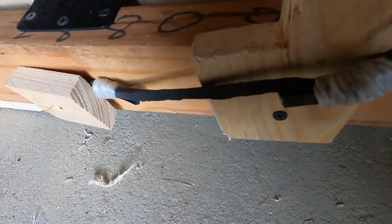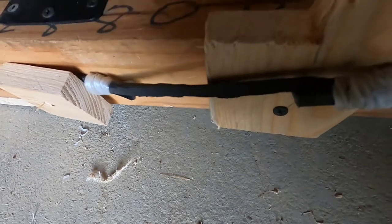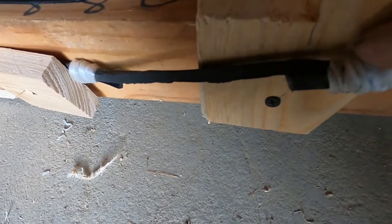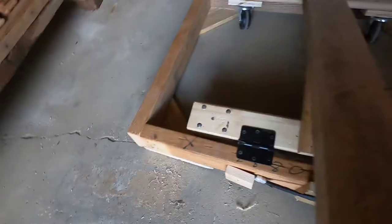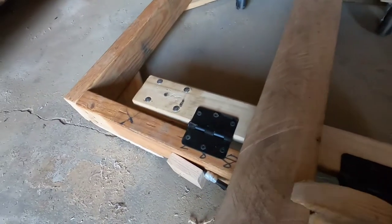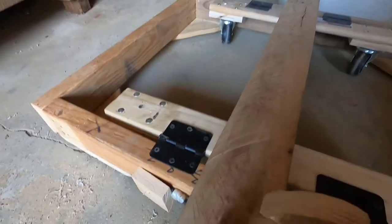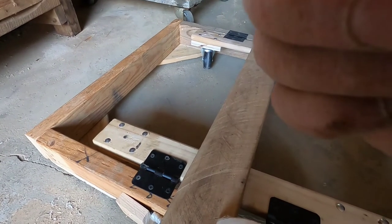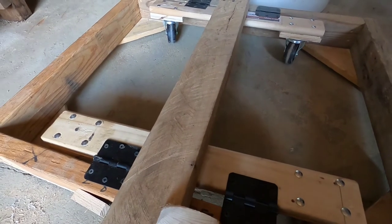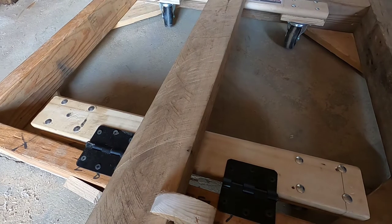There's no need for locking wheels because the table saw will be on this wooden frame, pulling tight with the strip of old tire connected like this. This may need adjustment once the table saw's weight is on it. If you don't want a lever like this, you don't really need it — you can just push this over by hand or kick it with your foot. Another option would be a board that presses down under the table saw itself, but I like this option. I'm going to try to get the table saw up on here by myself — it's pretty heavy — and if not I'll wait for help.